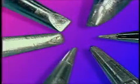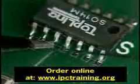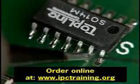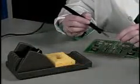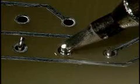Tip selection is important to reduce dwell time. A tip with greater thermal mass is preferable when soldering. Dwell time may have to be reduced for optimum performance with a low residue flux. This means the soldering operation must occur faster. Tip maintenance needs to be accomplished more frequently when tinning with a low residue flux to increase tip life. A good solder heat bridge is essential for soldering with a low residue flux, since the heat needs to be transferred faster.